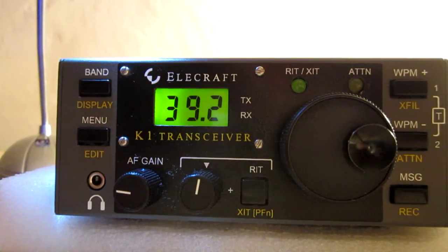Maybe the lack of the DDS, like in the K2 — the K2 is another great CW radio — but here there is a variable frequency oscillator mixing with the crystal, so there is no phase noise or any other spurs or other things from a DDS.